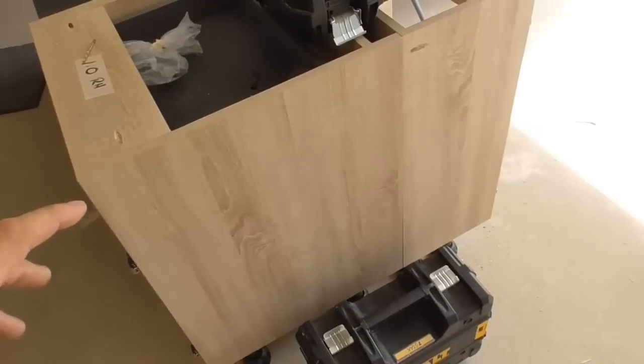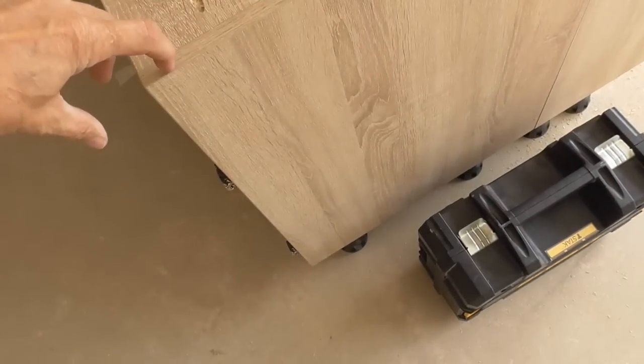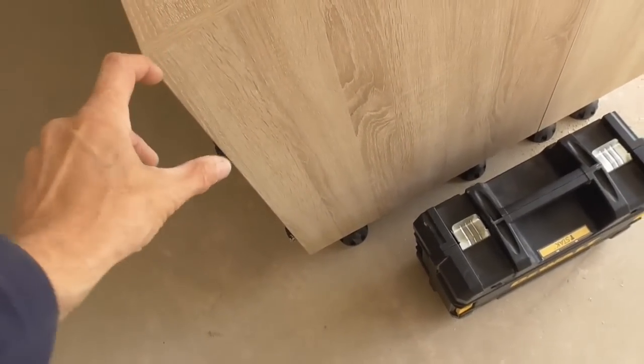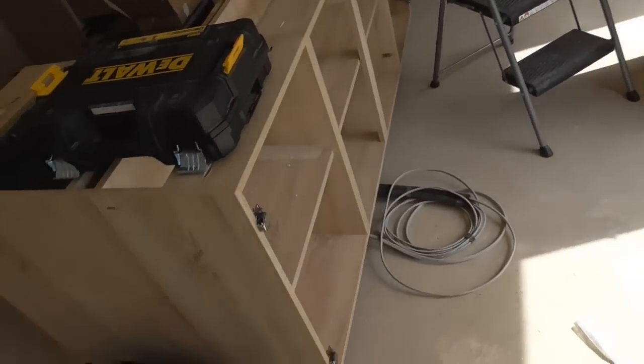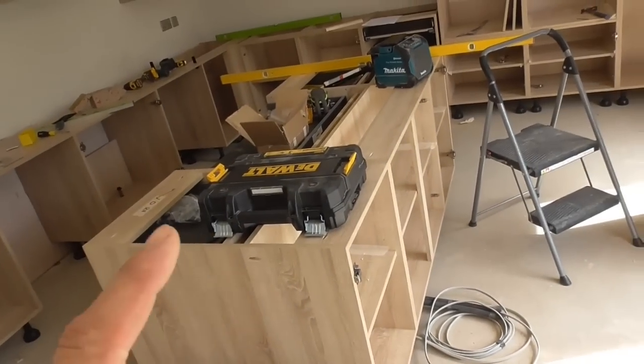What I'm going to do now is have a tidy up and sort of reset, and probably not going to do any more today. It's probably halfway through the day, so I've got some other things I'm going to shoot off and do. When I come back, we'll be going to start fitting all of these end panels. We've got a scribe over here, end panels to all go on the walls here, on either side of this wall unit, on the end of this unit here, and on this island unit we've got these rounded profiles that come around each corner. Then there's an end panel that fits in those and then it returns round, so we've got all those to start fitting. I'm just going to double check to make sure the island's in the right place, which it is.